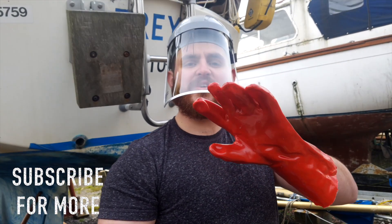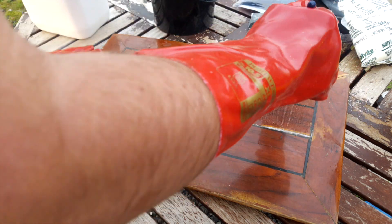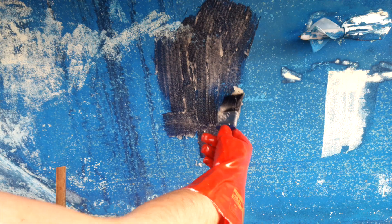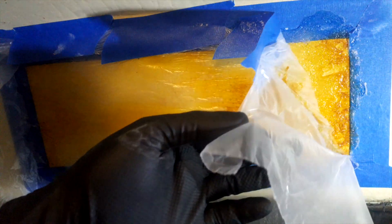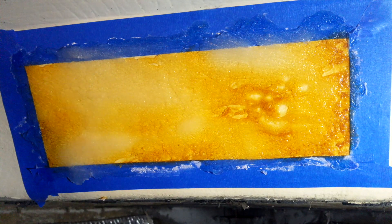As long as you've got your gloves on and protection for your eyes, it's not really an issue. Application with a paintbrush is how I've chosen to apply the gel and it's worked well, although you can apply it with a roller. Apply a thick layer all over the area you want stripped, but being careful not to allow drips onto areas you don't want to strip as it will obviously quickly ruin finishes. Although it's said that this mix doesn't dry out, I found that when I applied it in the summer heat it dried out quickly. The trick to stop it drying out was to cover the area with plastic sheeting — cling film would work well, but I bought a cheap roll of plastic dust sheets and cut them to size. Smaller pieces work best with the seams taped up with masking tape to stop the wind from peeling them away.